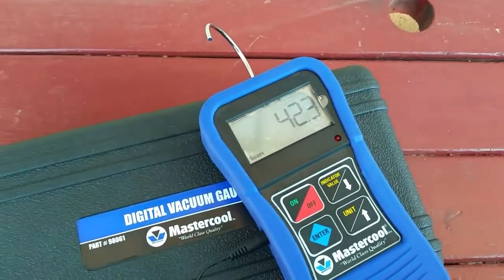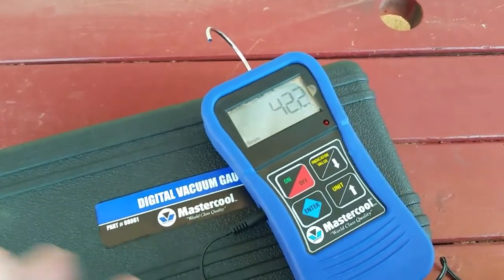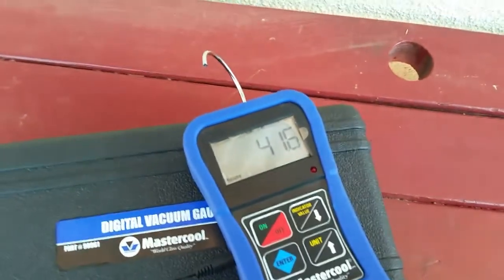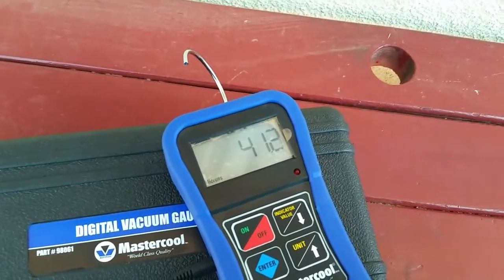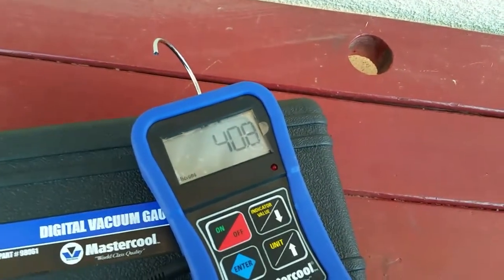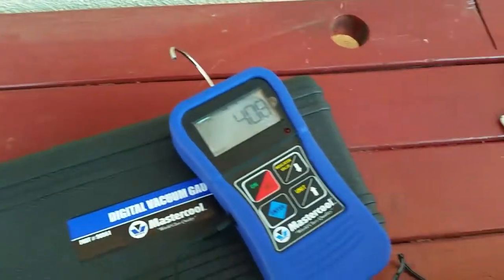That's the capability of this pump. And the typical vacuum level I found, even when I was working with this crummy thing, was 16 millimeters of mercury, which again is a lot lower than the 125 millimeters or 5 inches of mercury. 125 millimeters or 5 inches, the same basic thing. So yeah, this thing's very capable, way more than you need for automotive refrigeration, really.